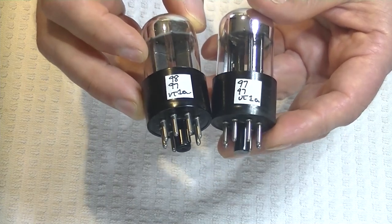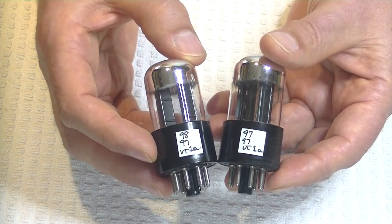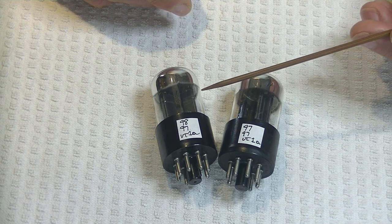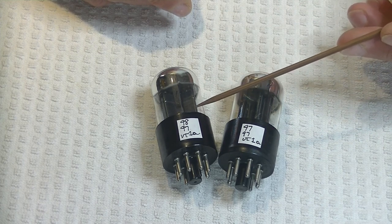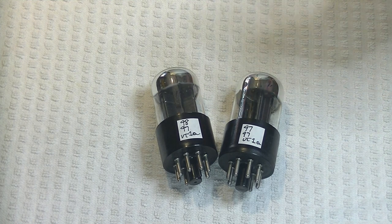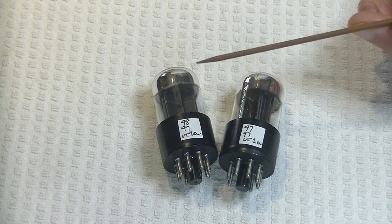What else can we look at? How about one of my favorite 6SN7s — the Sylvanias. These are the GTAs. The GTB and the GTA are virtually the same tube; the base type is a little different — one is shallow, one is tall, though they crossed over. The only real difference is the heater warm-up period. For preamp tubes, I find that really the GM measurement is all that I need. You could test these for emission, but I don't think it's required. I get good matches using just my GM measurement. The GM takes into account the ratio of the grid voltage to the plate voltage and the emission that results — so the emissions are buried in this calculation.